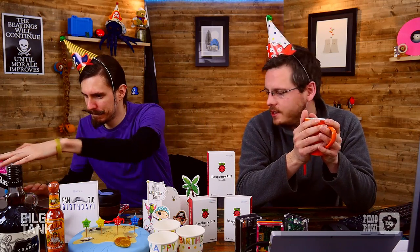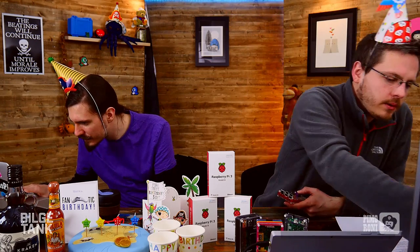We are going to be stocking heatsinks for the Pi 3. I think this is the first model where we feel there's any benefit at all. People have been selling heatsinks for Pis for ages, and it just doesn't matter. However, most of the heatsinks that are out there are actually too tall to work with a HAT board installed at the same time. So if you put one of these whacking great big heatsinks on there, and a Unicorn HAT or something, there we go.